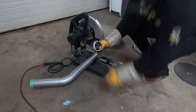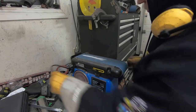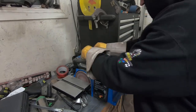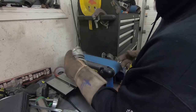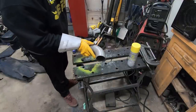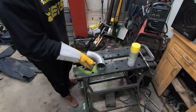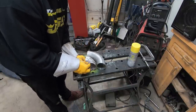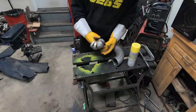Oh, I love that chop saw. I'm debating if I want to clean these up on here or just use an angle grinder with a flap disc. The cleanup kind of sucked. Here's the official comparison: here is a 3-inch 90 that I got with my mandrel-bent pipe, and here is the 15-degree pie cut — it literally fits within the inside radius. That is crazy. I wish I learned this skill earlier.